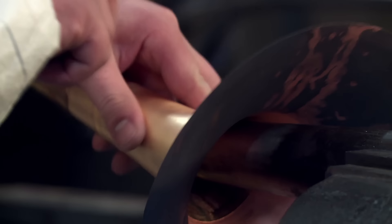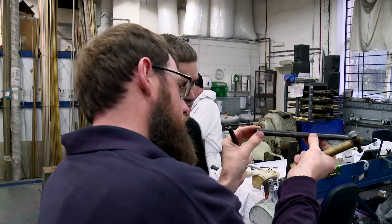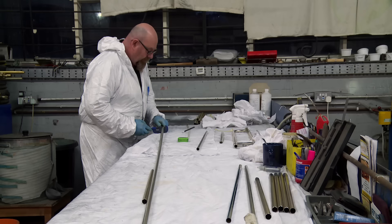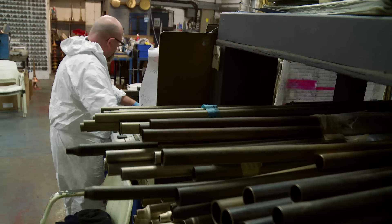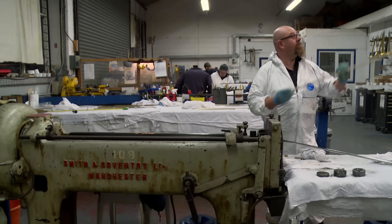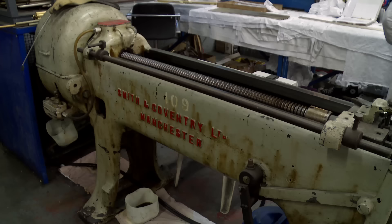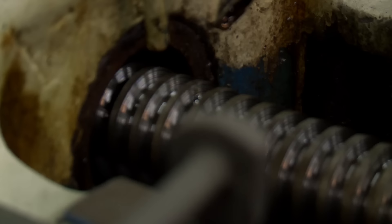It's starting to look a lot like part of a trombone. The company has been making trombones here since 1995. Alan Brown has been part of the team for nine of those years. Today he's finessing the inner slide. If you look around the factory, you'll see there's no computerised machinery — it's all old-fashioned stuff. Alan must make a tube that is just 0.2 millimetres, or two hair-widths, narrower than the outer slide. You can't buy precision like that, so they make them themselves. A 60-year-old broaching machine, originally used in a nearby colliery, has been given a second life and modified to do the job.